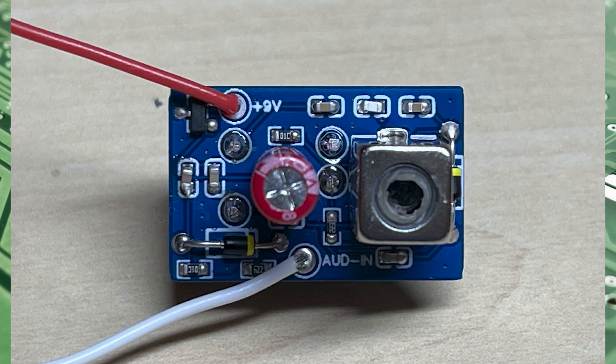This second VCO has the components for the FM audio modification, which is needed on the Multimode 2S and variants using the 059 chassis. This VCO has the parts that you would normally fit on the underside of the board, placed directly on the VCO module itself.